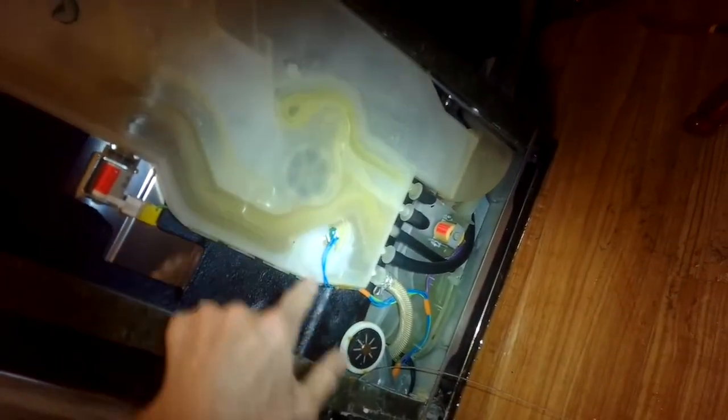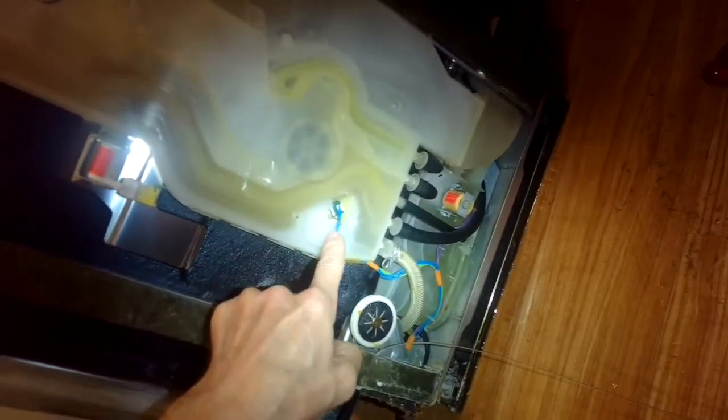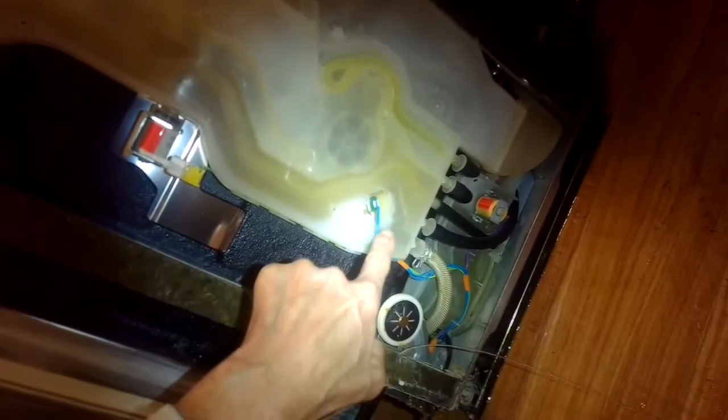On the Incognito model, with the right panel off, this is where the water comes in to the dishwasher. The water comes in from the fill tube through this line and goes past a little wheel that spins — this is called the flow meter. A lot of times with the Miele dishwasher when it's having trouble, this is a common part that may be having difficulty. You can just replace this, or if you can get it moving it will often fix many of the problems.